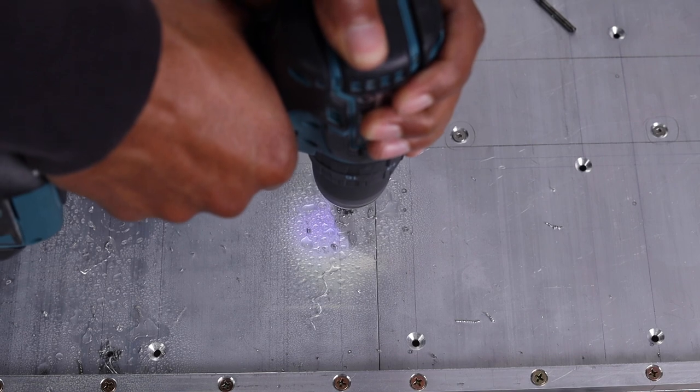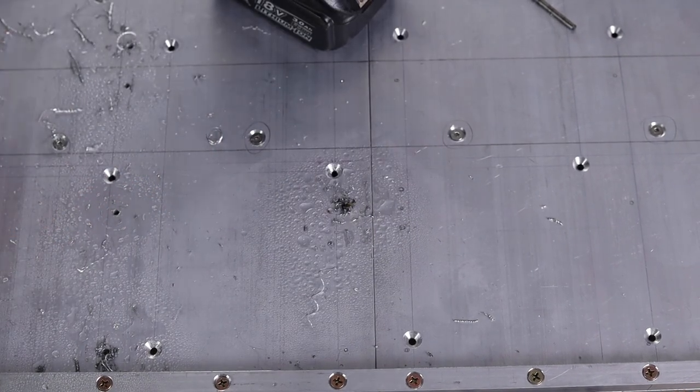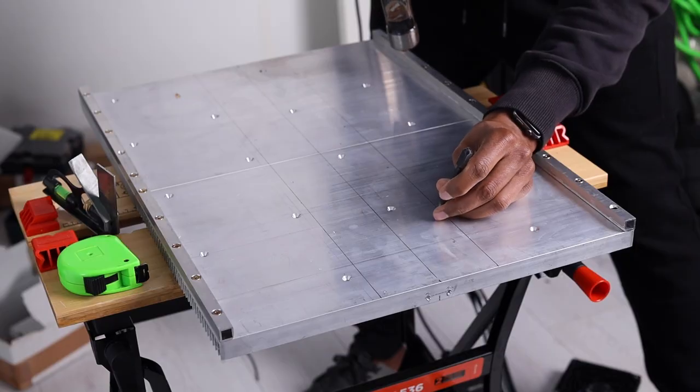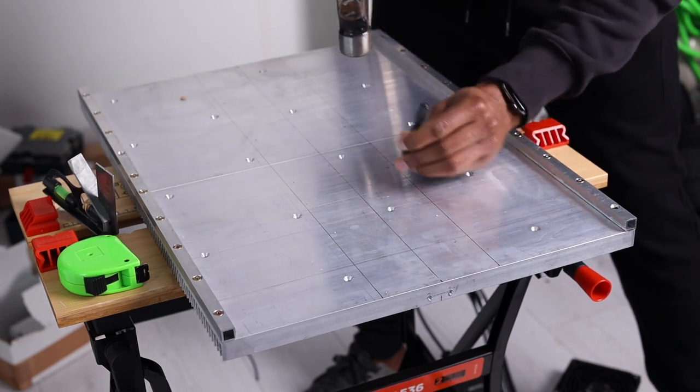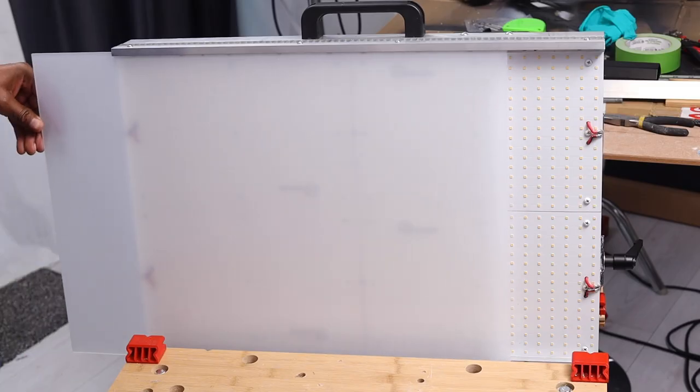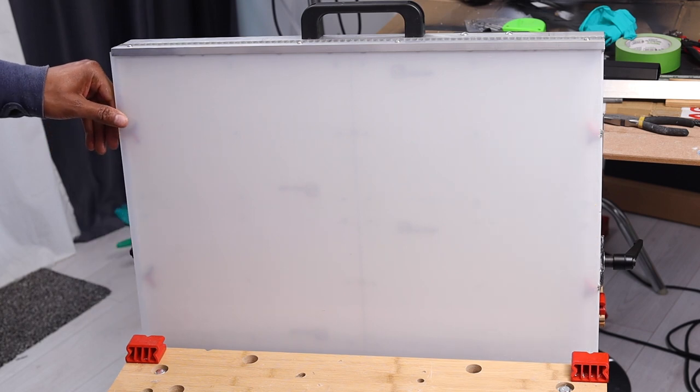A few tips to make your life easier. First, use sharp or new drill bits — get rid of the old ones in your box or you'll end up very frustrated. Second, use a center punch to create more accurate positioning when drilling your holes. Third, ask your acrylic or perspex supplier if they can cut the diffuser to your specified size so you don't have the hassle of cutting it yourself — just send them the exact dimension and slide it into position when it arrives.